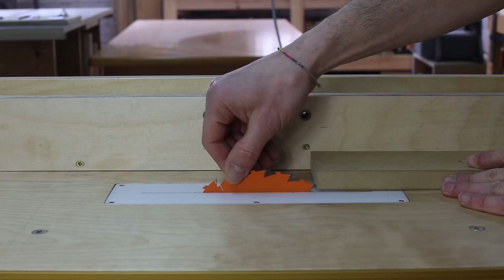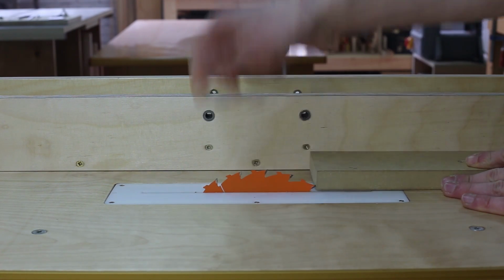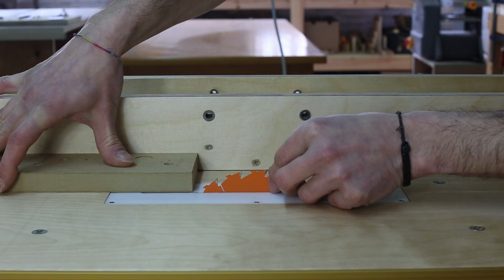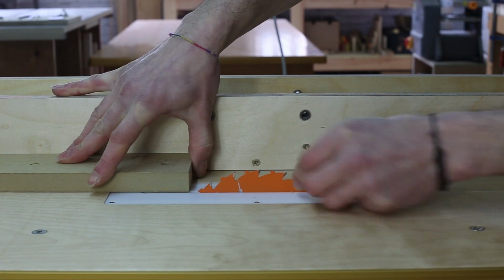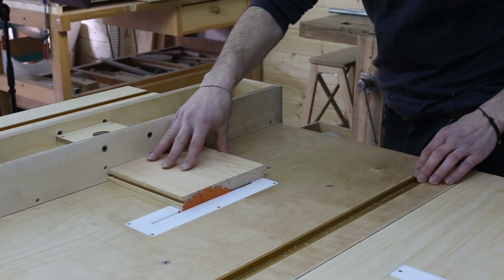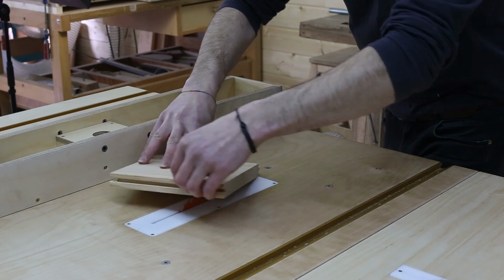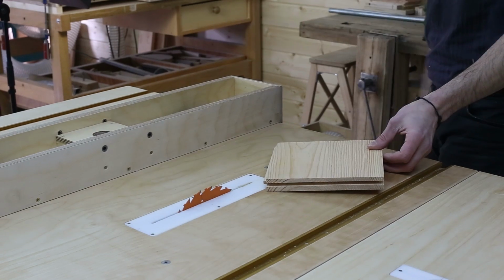The effect can be seen better here. When you start cutting, the rotation of the disc presses the piece down, so there is no risk here. But at the output, the disc can lift the piece, cutting your fingers and throwing the piece at your face. The effect could be something like this. Here I'll try to show you with the machine off, but in the blog I'll add some links, so you can see other amazing and dangerous videos from other users.